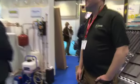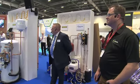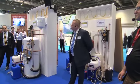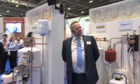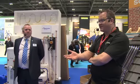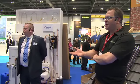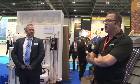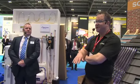Yes, sir. Thank you. A similar question, very quick question. A south-southeast facing roof, but it goes into shade in the winter from about 1 o'clock, 2 o'clock in the afternoon. So one wonders, is it worth doing solar thermal if your roof goes into shade for a 2 or 3 hour period at the end of the day? Short answer is yes. Solar thermal obviously is going to be affected by shade, but it's not as much as PV systems have traditionally been affected. There's no electrical consequence. Now, as part of the design process, the MCS installer will assess the level of shading from your roof and will give you a predicted generation of heat based on that location, orientation, and shading.